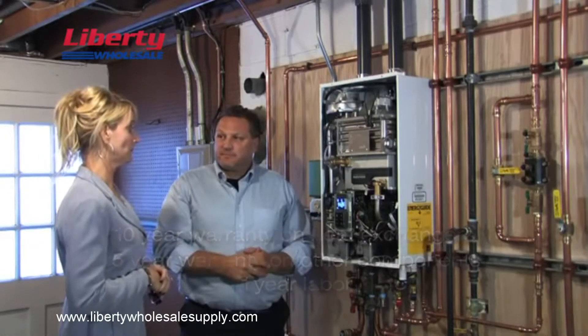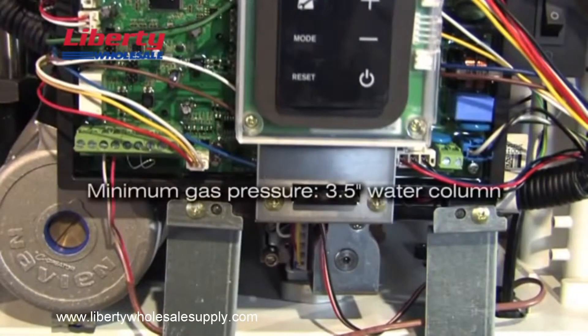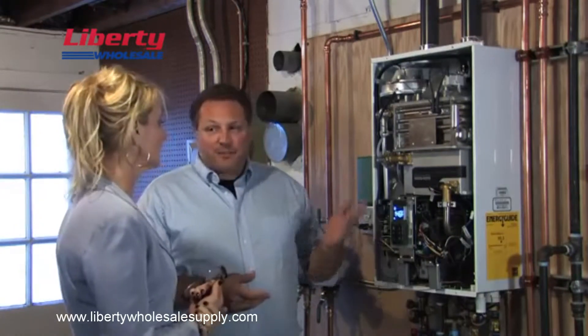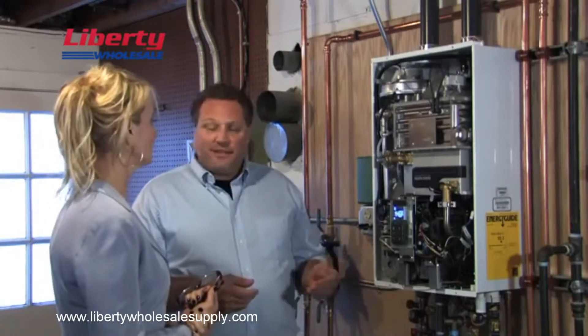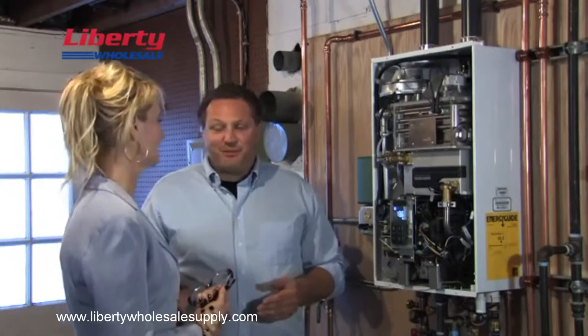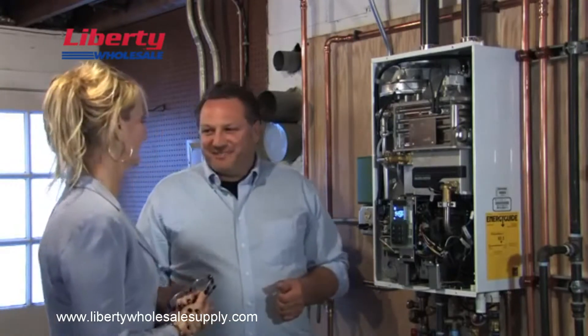That's longer than my old system. And look at this little valve — it allows the unit to operate with wide fluctuations in gas pressure. It'll keep running with a pressure as low as 3½ inches of water column. Is that a big deal? It can be. You'd be surprised how much gas pressure varies. In boiler systems, when the pressure drops, it shuts down and you're out of heat and hot water. One thing I do like about Navien units — I don't get a lot of callbacks. We love our customers, but we'd rather not see them too often, if you know what I mean.